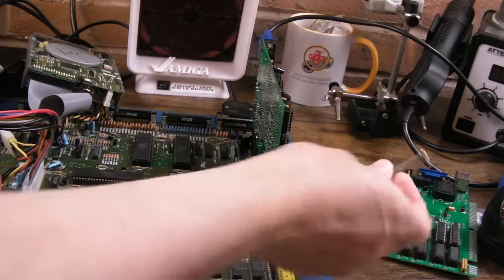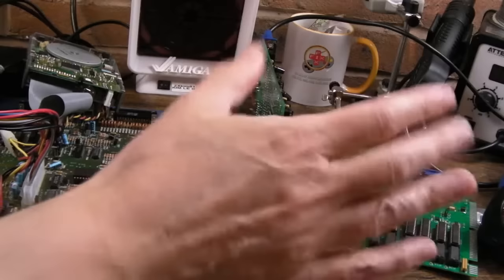With an actual Amiga power supply you've got a tick signal that comes into the power connector, and the jumper is in the upper position so it goes straight through. If you've got one of those original power supplies you probably don't have the loading issue because it's not using VSYNC — it's pulling tick straight from the power supply. It's only when someone's interfering with VSYNC via something plugged into the slot that you get this issue. A month later, this card is seriously doing my head in.